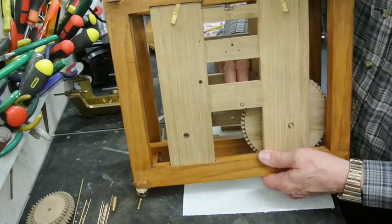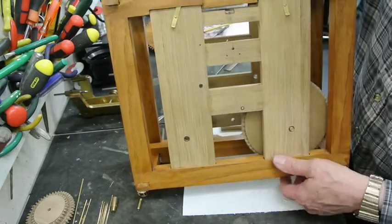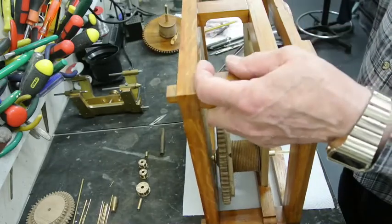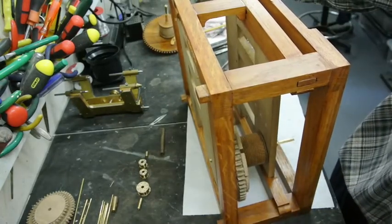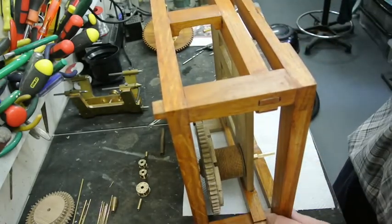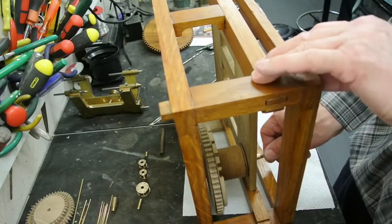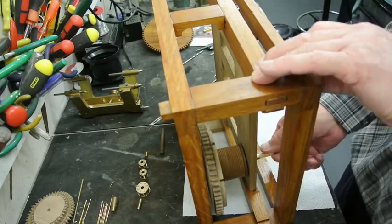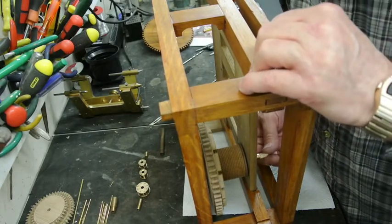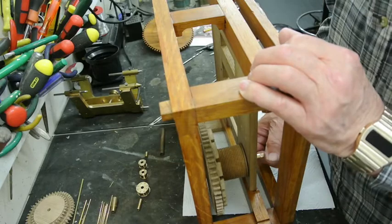I will cut down the amount of float in there, it has too much shake, a bit too much. And though the bearing fits are on, this is just a little bit too tight. I'm sure I can do this a little bit looser and make it run smoother. And you can hear it squeaking very slightly. You probably won't hear it on the video, but it's obviously just a shade too tight anyway.